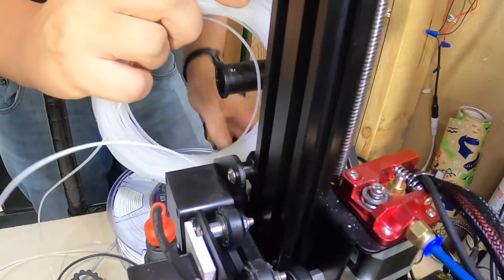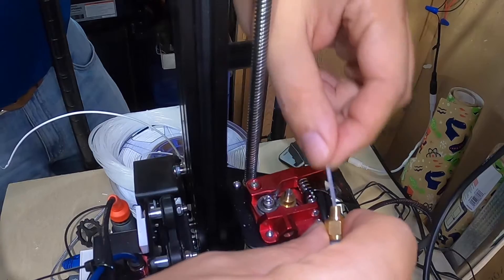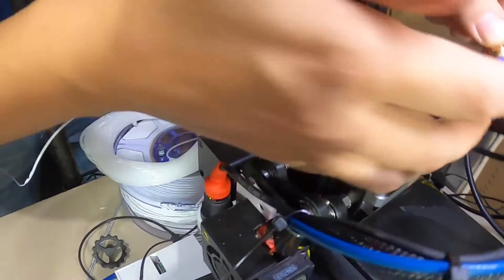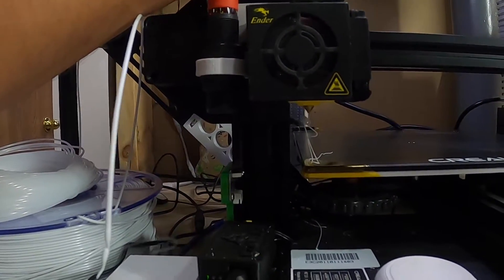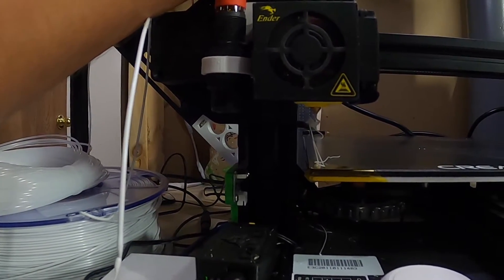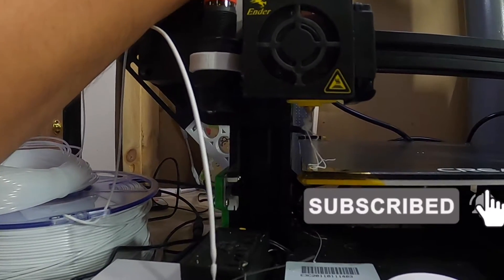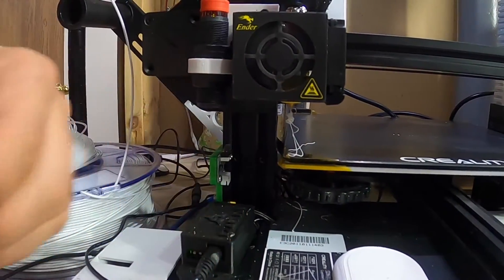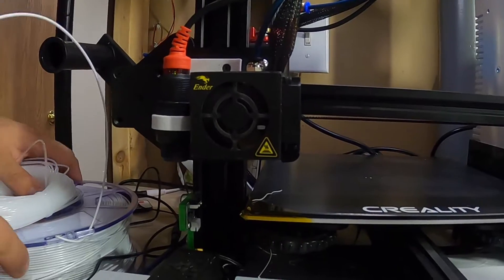Now I'm going to push in some cleaning nylon filament to get as much PLA out of the printer as I can. I'm going to take the Bowden tube off and push it through manually rather than through the extruder. You don't have to put a lot of pressure — this is a kind of nylon so it has a lot of flex. Coming down to the nozzle, you can see me pushing out old PLA. We don't want that as part of our PETG print, so we're just cleaning the printer of the old filament. This is a slow, tedious process, but you can see it getting clear, which means we're getting the cleaning filament through. I'm going to pull that back — you can see that bulb of goo that came out of the printer. Make sure the nozzle is good and clean.